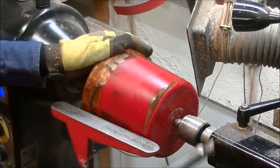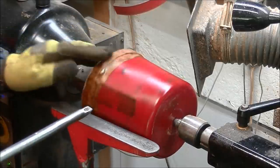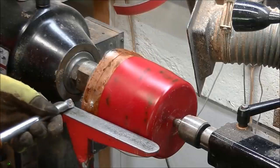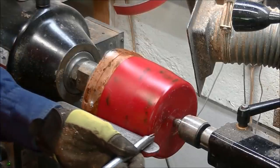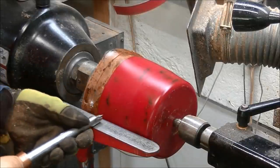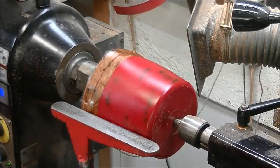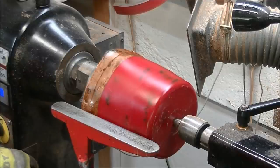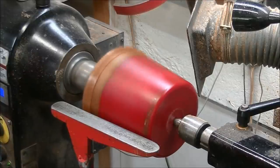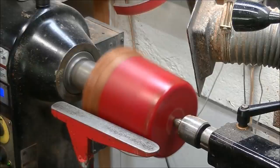I'll start off with a square cutter with a 2-inch radius, and I'll come in here at 45, nice and slow. I'll come over here to the end, and then I'll come in this way, same thing down this way. If you come like this on the end, you're gonna chip a big chunk right off the end, so you're better off to come in within half an inch or so, and come back this way with it. Face shield on. It's worth it. See what we got going here. I start off a little slow, about 2,500.